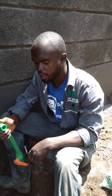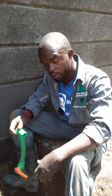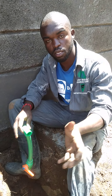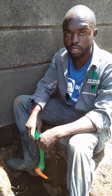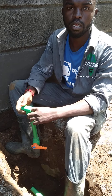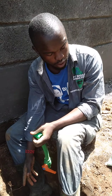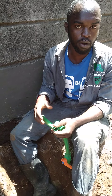Hello, my name is Paul and I'm working under PIPAT biogas contractor. Today we have come to set a biogas water trap. This is where the vapor which comes from the biogas digester normally remains, so that the gas can pass through and be used in the kitchen. When water and gas are mixing at the kitchen there will be no gas, so we set the water trap here so that the vapor will remain here.